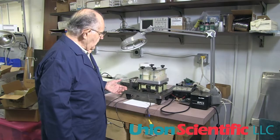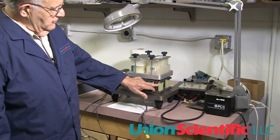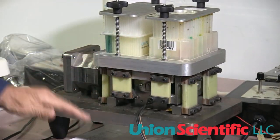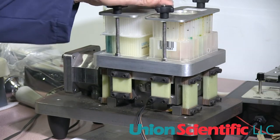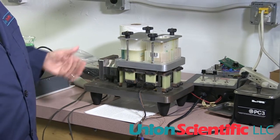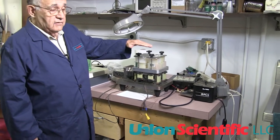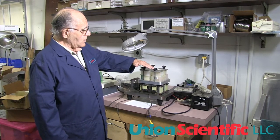This machine I call a Vibro Tornado. It's a platform mounted on springs — these white things are reinforced fiberglass leaf springs, supporting a platform that can shake back and forth in one direction. There's an electromagnet that shakes back and forth 60 times a second. On that platform is a second set of leaf springs with a second platform, and that shakes in and out 60 times per second. This machine is designed so that when it shakes in one direction, by the time it gets to the end of its stroke, the other axis is energized and it shakes that way — going in a kind of a square.